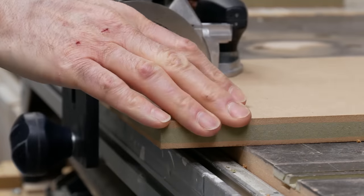The connectors fit into the keyhole and tighten up as you slide them home. That's an immensely strong joint that can be handled immediately. If you want to make it a permanent joint, it's just a question of running a bead of glue in there as well, and it'll clamp itself while the glue dries — a very clever system. The peanuts are around 15p a piece, so a little over a pound's worth for this entire carcass, and they get cheaper as you buy them in quantity.